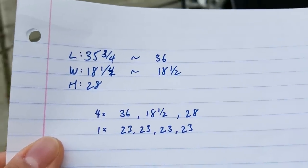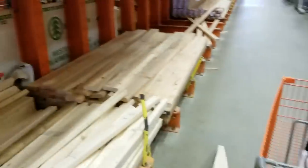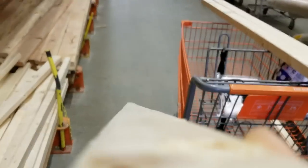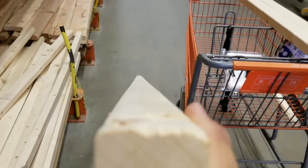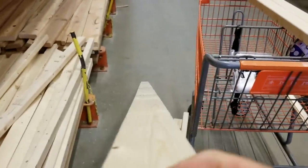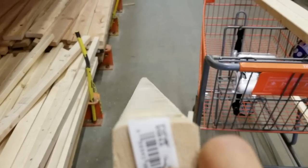So now let's go to Home Depot and grab some wood. I like to go to Home Depot because they have the cheapest prices. What you do have to do when picking lumber from any store is inspect each piece, making sure they're not curved, bowed, or twisted — just look down one end making sure that it's true.